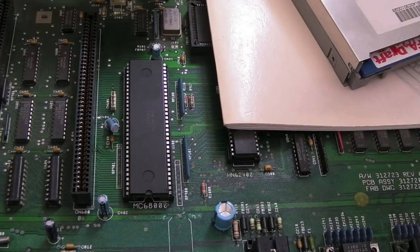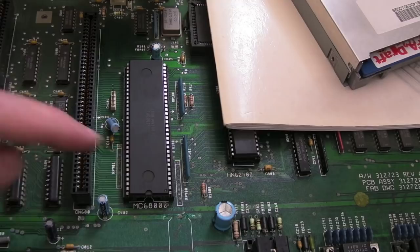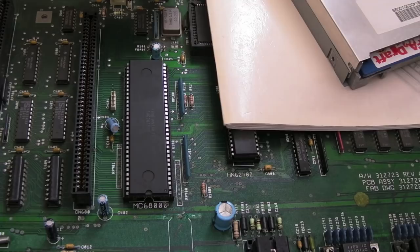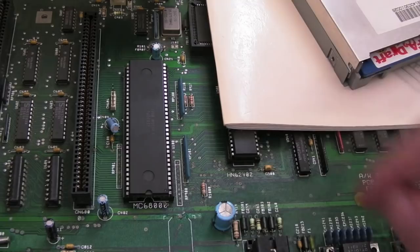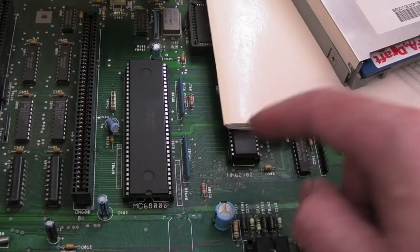Testing off the carpet here, but it booted first time — no worries at all. The CPU pins have just a little bit of oxidization or corrosion still, but the socket is good. There are only three or four actually green pins and one or two on this side, but they've cleaned up okay with vinegar. This is just to show you that you don't always need to replace everything — some of these traces could fail with a bit of current over time.